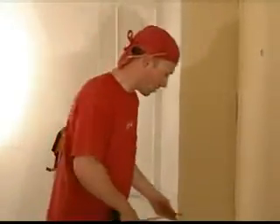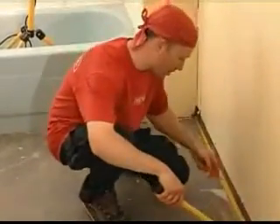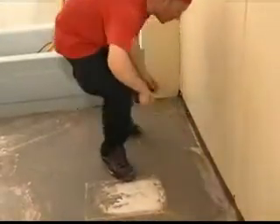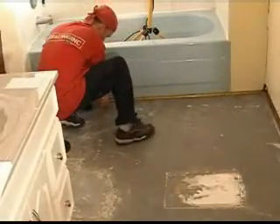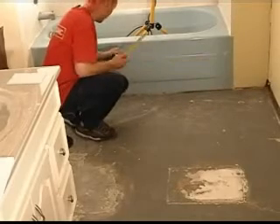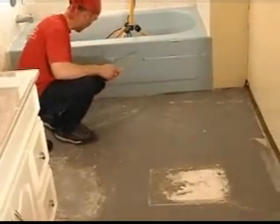If your wall was straight, you look down at it — you have two straight walls that work. What you want to do is grab your tape measure and measure down from the corner. You'll go from the corner down and mark off three feet. Then come across to the other wall and go four feet. You want to make sure your lines are in the same spot on both sides — straight down from the wall is where your mark is.